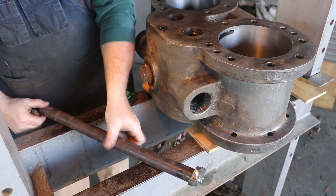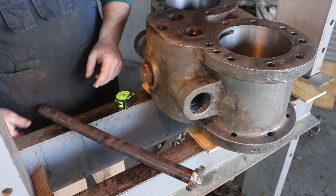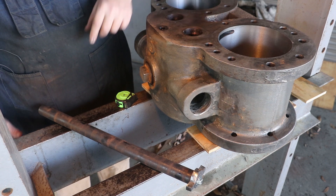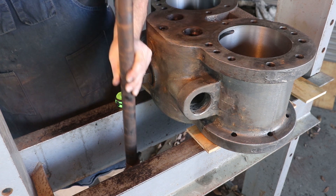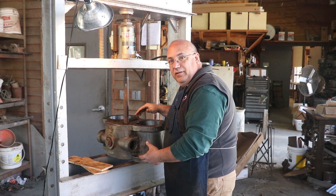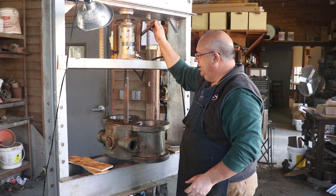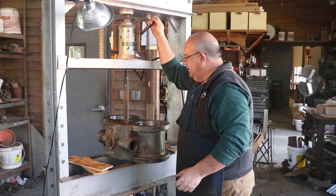Here's my push tool — just a piece of round rod with a drilled and tapped hole in the bottom. I'll feed this rod down through from the pressing side, which doesn't have that full opening. I've got the little spacer piece down in the bottom that we're going to press on, and our hydraulic jack in here. I'm just going to start pressing by hand and see what happens.